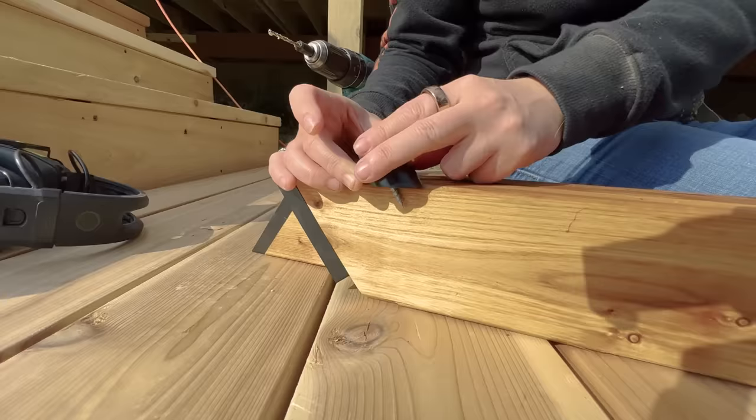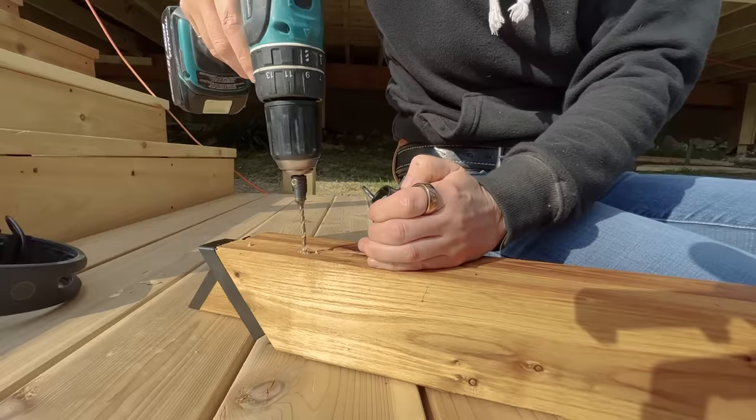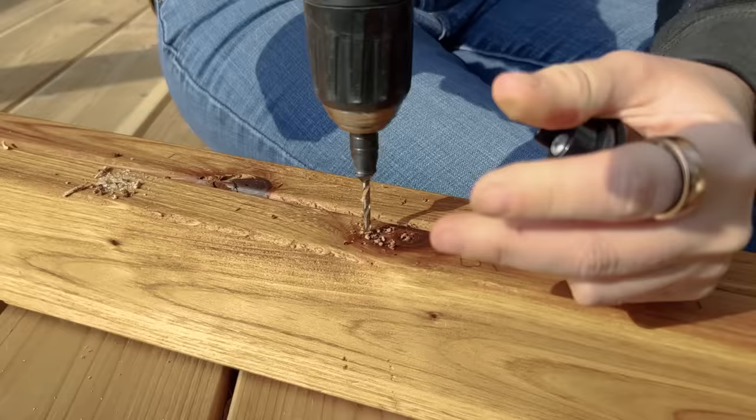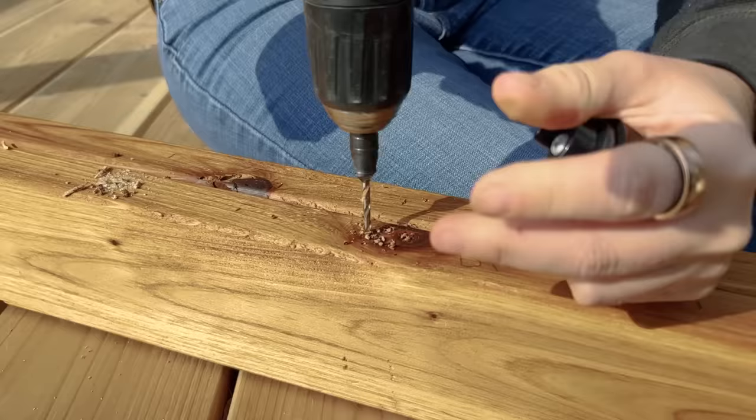Whenever pre-drilling for these, instead of going in straight like the traditional railing, you need to go in at the diagonal that the screw needs to set in. So you can start the bit and then lean it over. Unlike the traditional railing where the baluster clips can go in any orientation, when mating with the diagonal ones there is actually a key on them so they can only go in where these two points go into these two holes. You pop it together first, then insert the screw into the center, and now it can be placed into the different locations.